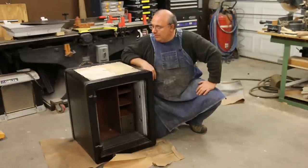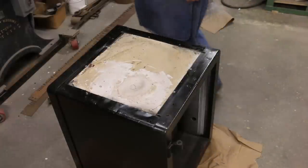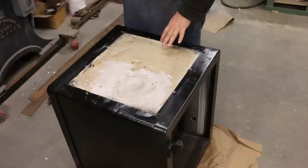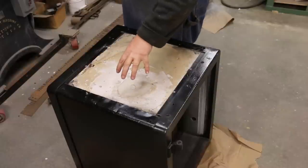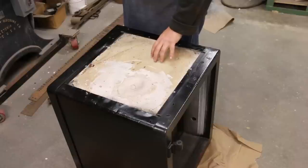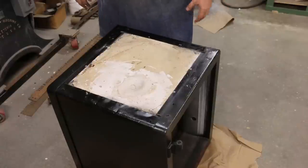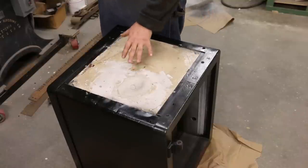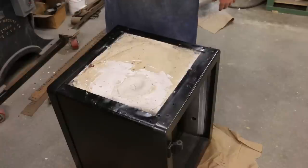We're going to bring in here and show putting the wheels and casters back on — the ones we had to repair in an earlier video. You can see here the repair I did inside. If you remember, someone had tried to break into this at some point and literally chiseled a hole out of the refractory in here — this is kind of a high-temperature material to withstand fire. They basically got down to the steel plate in the bottom and couldn't go any farther, just tore it up. I've filled it back in with some high-temp refractory. It sunk in a little as it dried and cured but it's going to be fine — it'll all be covered up and never seen again.